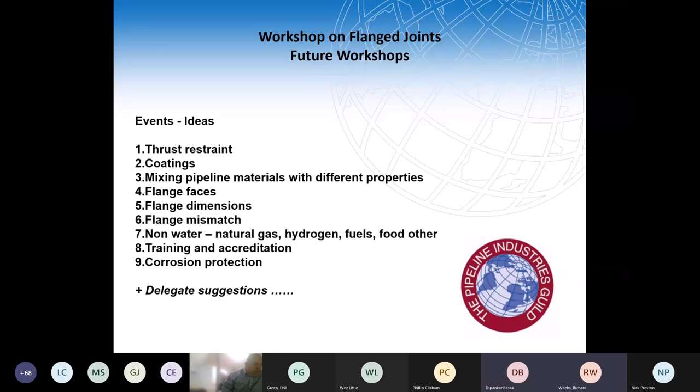Yeah, to isolate out vibration from rotary equipment, we tend to use bellows, a similar type of joints which take some shock. I think what Andrew's referring to is very much related to process plant above ground, and the flanges tend then not to fail catastrophically, but as a simple leak. And quite often then the designer will have used different washers.